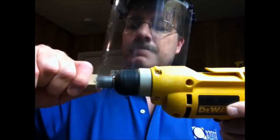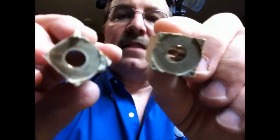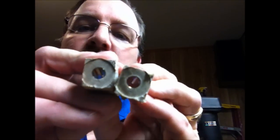You can see there's a little discoloration on this blank compared to the one done on the drill press — I think it's due to the lower RPMs of the hand drill and holding it on there. I got it right down to the barrel. That discoloration won't hurt you because the nib, the trim ring, or the cap of the pen will cover it. I went ahead and finished the other side on the drill press just to save time. Both methods work.